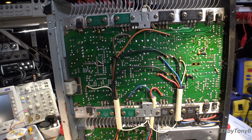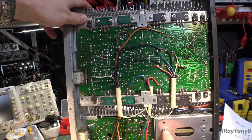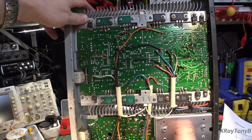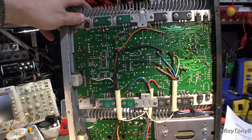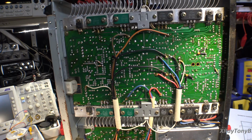Okay, so the bridge rectifier was perfect, so I just cleaned it really well. And I took the time to kind of clean around the power transformer and everything. I put it all back together. I did notice that these screws were pretty much stripped, which was why they were so loose. So I ended up having to put nuts on the bottom of the 4 screws for the transformer. No biggie. This thing must have really took a hit when it was shipped.